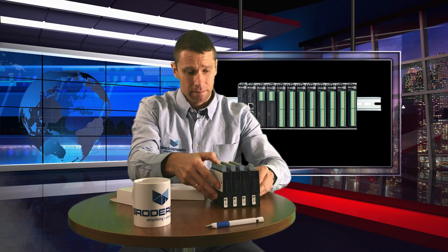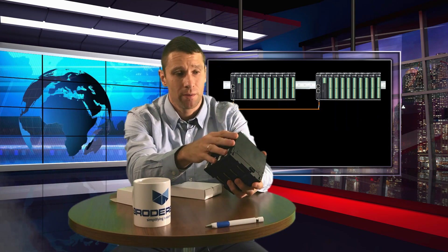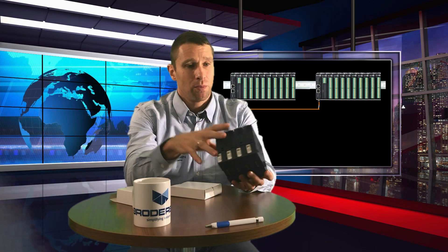Let's put the power supply in right here. It's kind of like Lego — you've got two parts, you put them together and it goes on, even DIN-rail mountable. You can take the modules in and out like this. This power supply here is 9 to 30 volt, and the next is 30 to 60 volt. So it depends on whether you're running 24 volt, 12 volt, or 48 volt — that determines which power supply you should select.